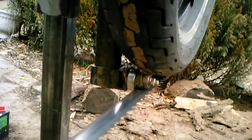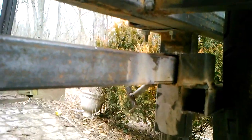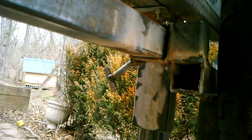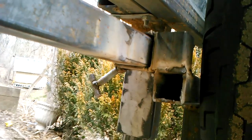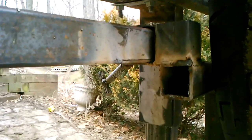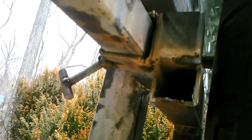And there is a slightly different blade guide over here. That one is actually welded permanently in place, even though it looks like it's built to be adjustable. I ended up breaking that during part of the move and assembly process. I built it at a different location, and it's just not as strong as it should be. So if you look in there, you can see I've tried to weld it back together, but ended up just tacking the whole thing in place, which should be strong enough.